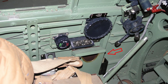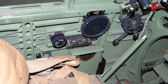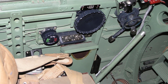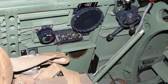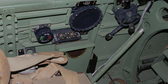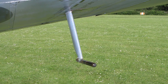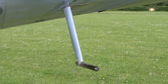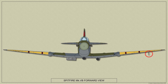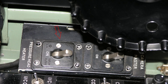A metal case for a writing pad and another for storing maps and books are fitted on the left hand side of the cockpit. Stowage for a height and airspeed computer is also provided below the wireless remote contactor mounted on the starboard side of the cockpit. Here we have a view of the ASI — that's airspeed indicator — heating element pressure head. It is mounted under the port wing and is controlled by the pressure head heater switch located just below the trimming tab hand wheels.